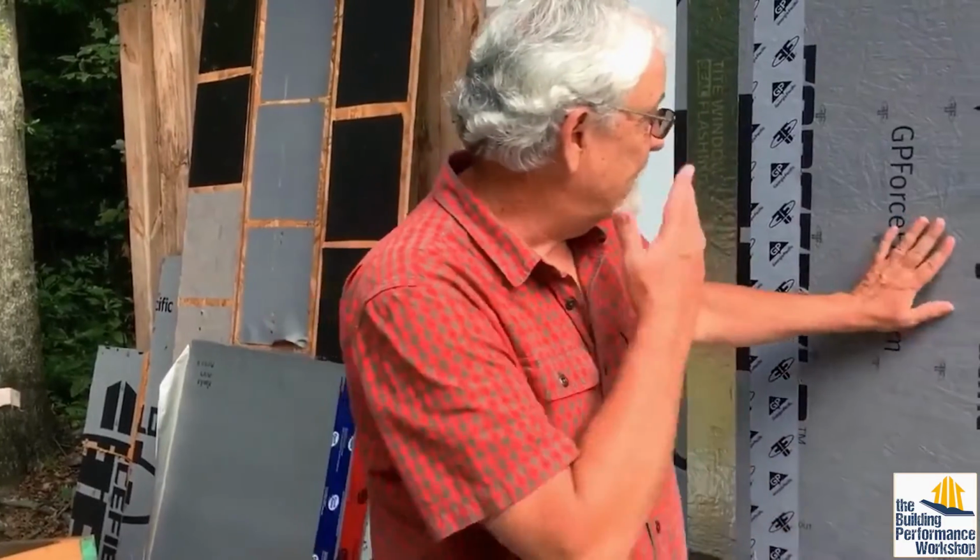You know, we've been using housewrap now for, it's 80% of the market. It's my opinion that's going away, that we're going to tape systems, and that's what I promote. More than anything here at Washington Springs is the promotion of a tape system and how you can use that in the best way to practice tape systems. Why is it better? Number one reason is air infiltration. You will not get down to 3 air changes per hour with housewrap unless you make that housewrap trap water. That's the only way you're going to do that. So having a tape system with no trapping water overlay on it, so that you can shed that water away, is much better. And the tape's going to give you much, much better air infiltration.